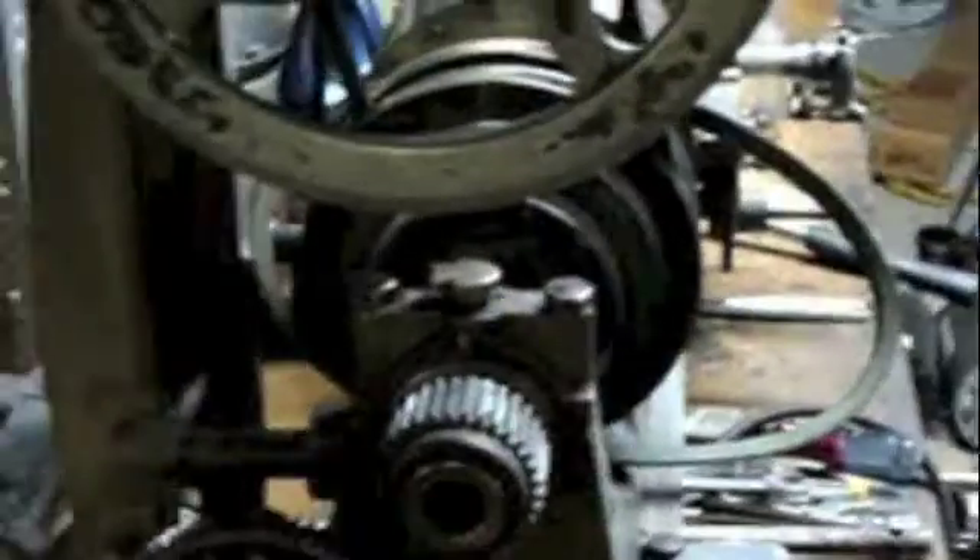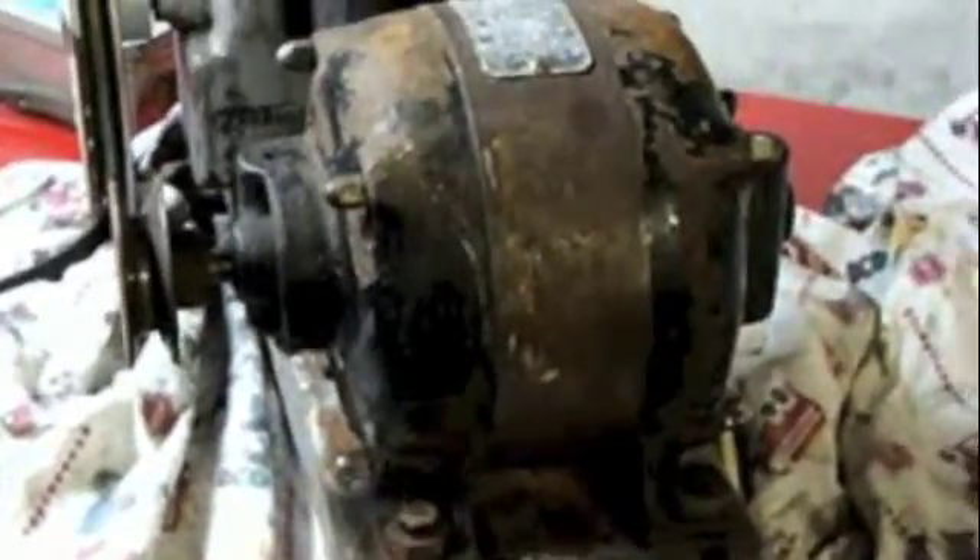Imagine we've got the motor mounted here where counterclockwise rotation gives us counterclockwise rotation on the spindle, which means the chuck will be going in the wrong direction. You want the chuck turning this way - counterclockwise from this direction, which would be clockwise from the other direction. That motor is not going to work unless we can do something to reverse the direction on it.